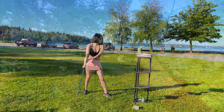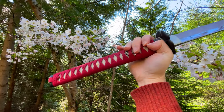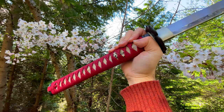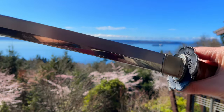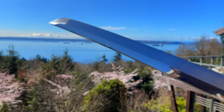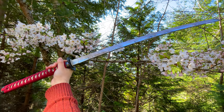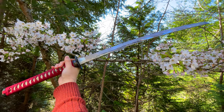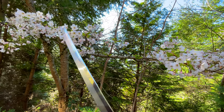Overall, the hilt is still well done, with a balanced and tasteful design that's not overly gaudy. The distinctive hilt design is not to diminish the merits of the blade. It has a very typical shinogi-zukuri blade geometry, of a very average length, 28-inch blade with the habaki included, which leaves a nagasa of 2 shaku 2.5 sun.